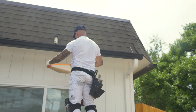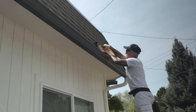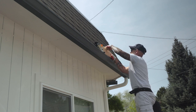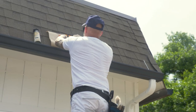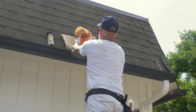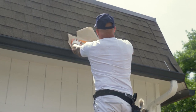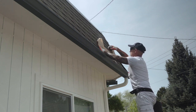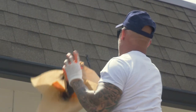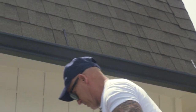Here are these silver brackets up on the roof. All we're doing is taking some nine-inch paper and putting it on the sides of the bracket, then spraying it. Right now it shows up really bad as silver. This oil-rubbed bronze is a way better match to the roof. If you've got a black roof, you can spray them black — just depends on your roof color. It's a little windy so I'll hold my mask in close. The oil-rubbed bronze covers fast and easy; I don't need to wait for it to dry. Just like that — a simple little detail tip to make your job look a lot better when it's done.